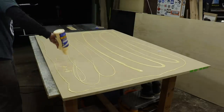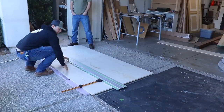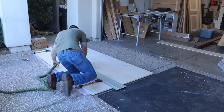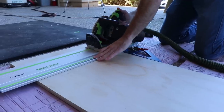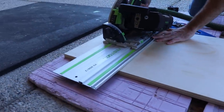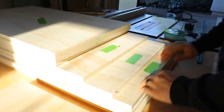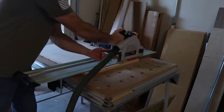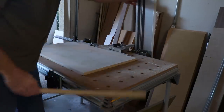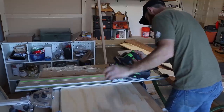Here I'm doing the MDF the same way. That guy on the left is Oscar, my buddy from Naughty Dog Woodshop — he offered to help me out on this build and he's really good at cabinetry. He actually has a YouTube channel which I'll leave in the description below. We had a lot of sheets of plywood to break down — about five — and using the track saw to get stuff rough cut was a really big help. Once it was all rough cut we labeled everything: panels, doors, drawers, dividers, all that good stuff. What you're seeing here is the MFT by Festool, a track saw workstation with a track that flips down and a fence on the back so you can really start squaring everything up. This is where we made most of the final cuts for the panels and dividers.